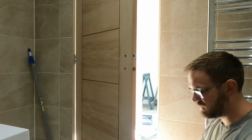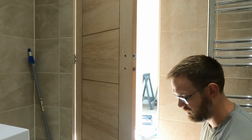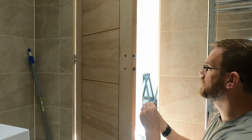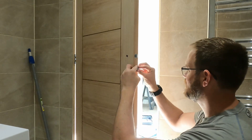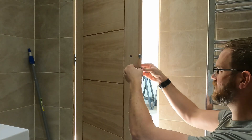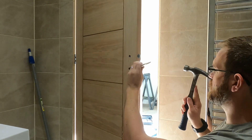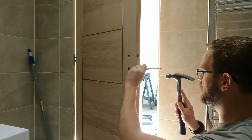The way I do it is so that the thumb turn, when you turn it, goes into the lock rather than the opposite way. If you've got thumb turns going one way and a different way it just seems a bit stupid. So always have them so when you turn the latch it goes towards the striking plate.